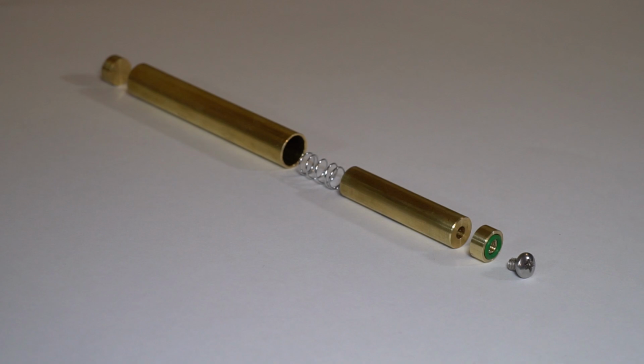As previously stated, these chambers are essentially just shock absorbers. They consist of a vessel which is plugged on both ends by a pair of end caps, and of course, one of these end caps is going to have a hole in it to replenish the fluids. The method of sealing is non-permanent. This means that you can undo the screw and the O-ring, and you could swap it with different weight of fluids. The key component is a brass weight.